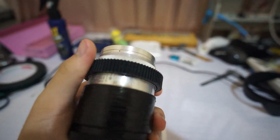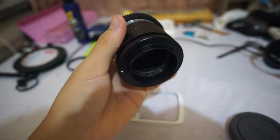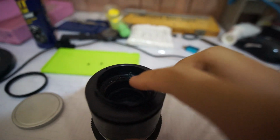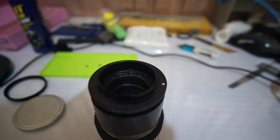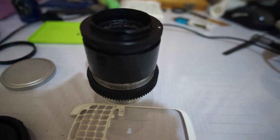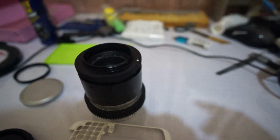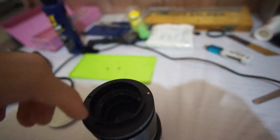See how this thing focuses this light is that I took one of those pins out on the inside of that rangefinder cam. This thing has this rangefinder cam which actually rotates. Let me show you this thing. There you go. See, I actually put some blue tack on that thing right there. Now why I protected that thing was that it was spinning around, and if it spins around, this thing will not turn up to infinity. So what I could do is reduce the length of this pin. But what I did instead was that I took out the pin that holds this thing from turning around.